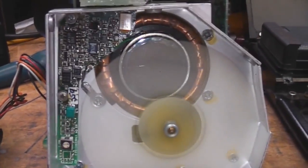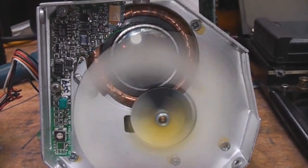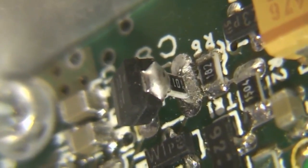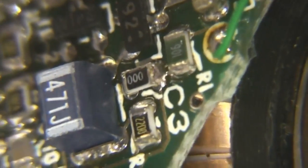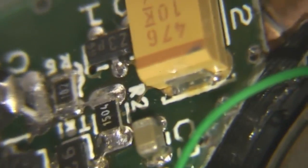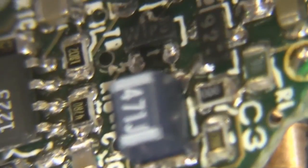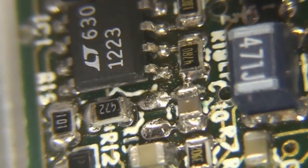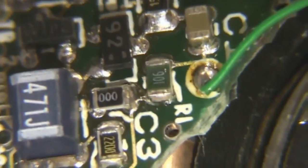There's a little bodge there - they decided they need a resistor in series with this cap so they just lifted the cap off and stuck an 825 ohm resistor in series with it. You'll notice where that green wire comes on, that green resistor is a 10 meg resistor. This is all sort of high impedance stuff so that's maybe a bias resistor - there needs to be a high impedance because the output impedance of the tube is very high. That's almost certainly going to be a FET front end, giving a nice high impedance input so it doesn't load down the tube output. That's going into an LT1223, which is a 100MHz bandwidth current feedback amplifier - that's doing the second stage of amplification after the FET stage. The front end is probably just a buffer to get the impedance down, then gets amplified by the LT1223 and goes out to the rest of the circuitry.